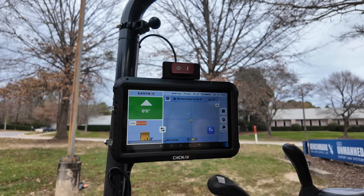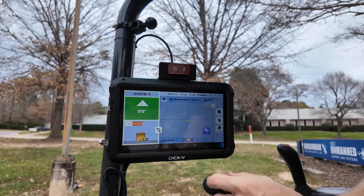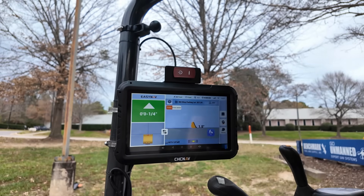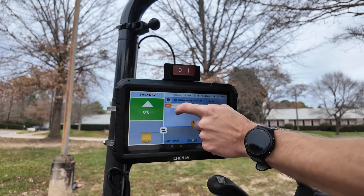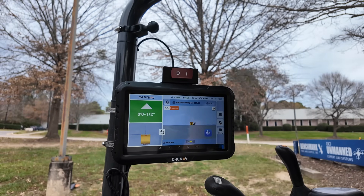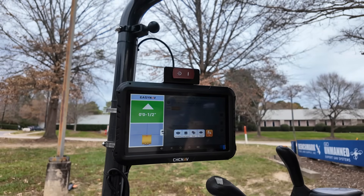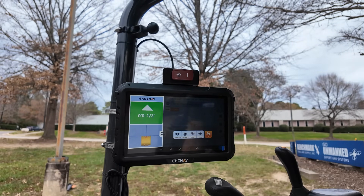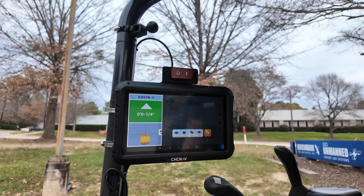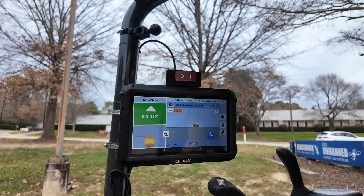You can have multiple buckets, up to tilt buckets, and select that to change between a two-foot dig and a five-foot fine grade. If you want to change your views, you've got the double arrows here — that will make your profile and section view the big view. When you tap the quick easy button, it brings up the surface selection and you can choose to create a flat plane surface, a sloped surface, a line and trench, or a foundation. What makes this system powerful is you don't need any CAD software or programming skills to create a surface on the fly.